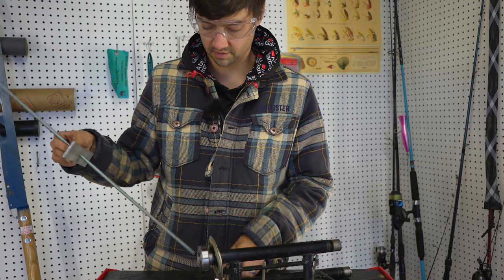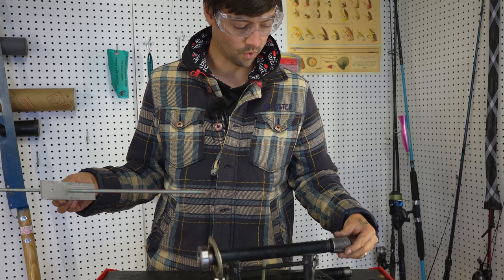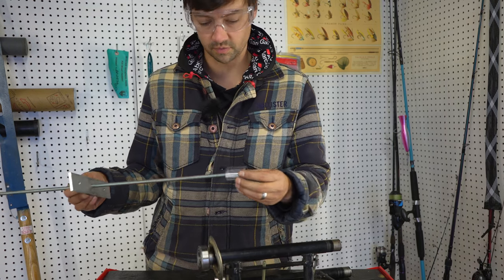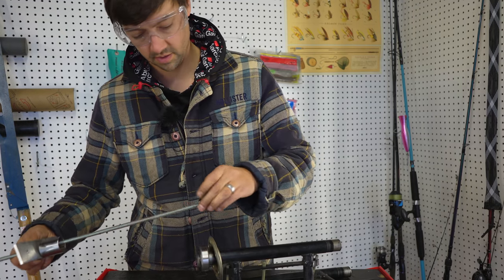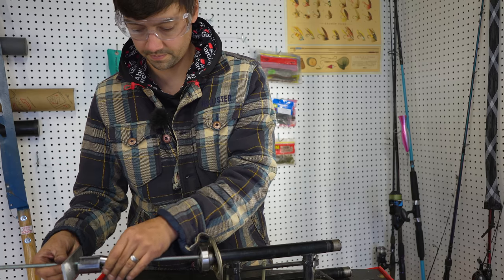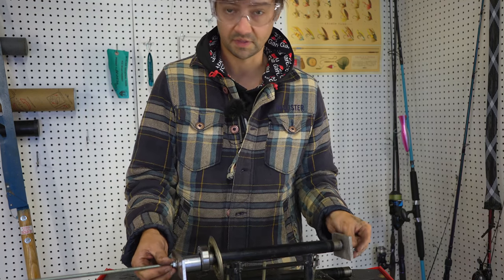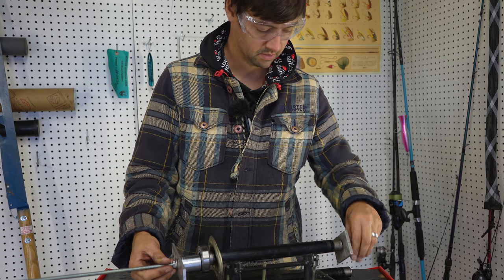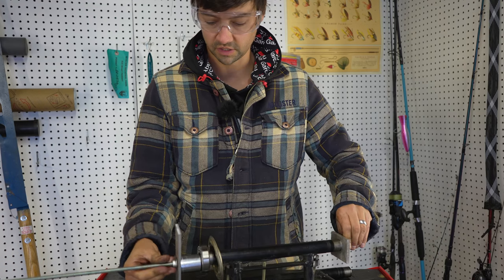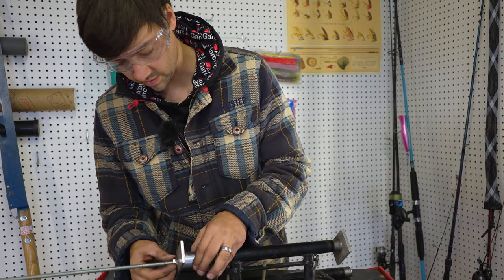without a press. And then what we're gonna do is we're gonna take a socket, like I said, that fits over the shaft perfectly to press on that inner race to squeeze it on all the way up to the back flange there. As you can see, I've done this quite a few times. 8 to be exact. I probably could squeeze 2 of them on there once. It's just too much stuff to go wrong. You don't want to bugger up one of the new bearings you just bought.